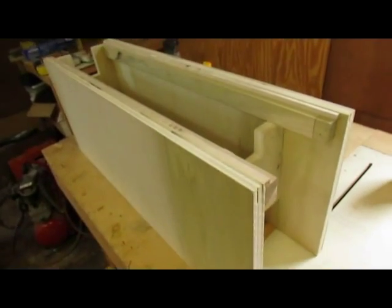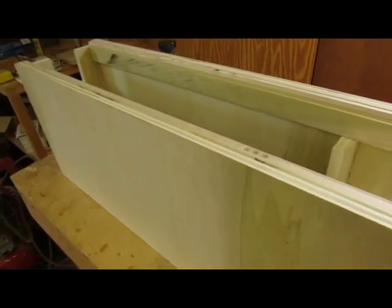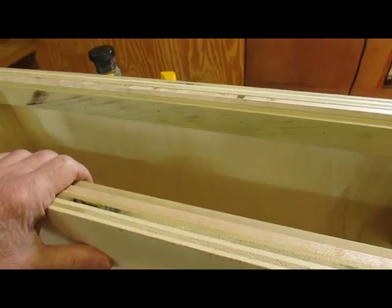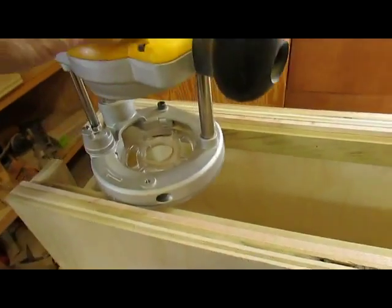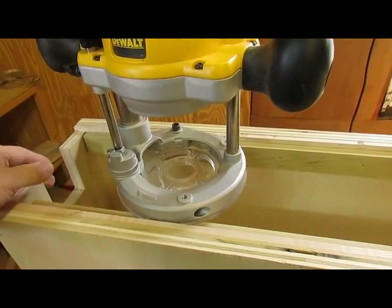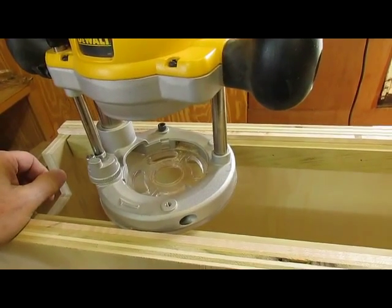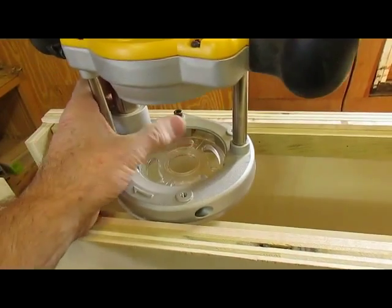To do that, I made a jig here - I've done this before with the smaller ones and it fits on my lathe. We'll see that in a couple of minutes, but it's made so that the router fits right between it and I can slide it along. I've got an indexing device on the lathe so that I can turn the column around the diameter and hold it in place while I run the router down to make the flute.